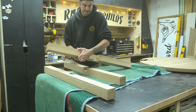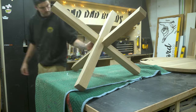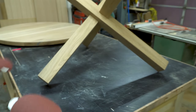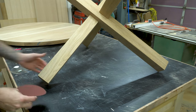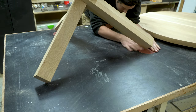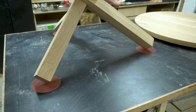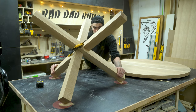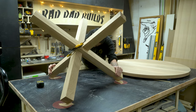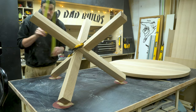Before applying the finish, I needed to make sure the whole thing fit together correctly — and it did. I also needed to create flat spots on the points where the legs meet the floor and where the top of the base meets the tabletop. I stuck 60-grit sandpaper to my bench and shuffled each piece down until I got a nice consistent flat spot, making sure to sand each piece consistently and check that the high spots are all the same throughout.